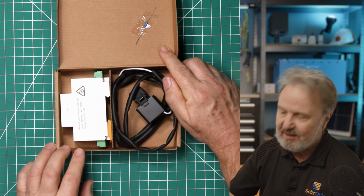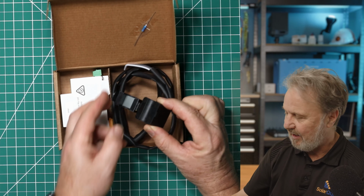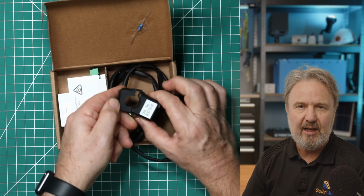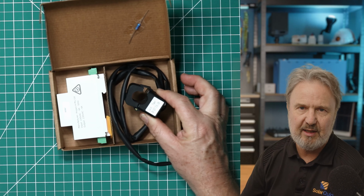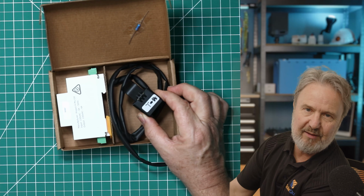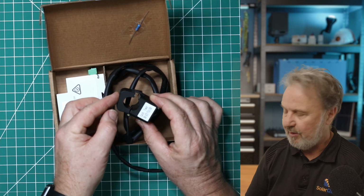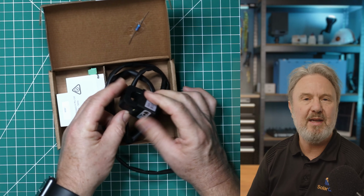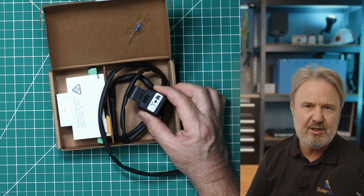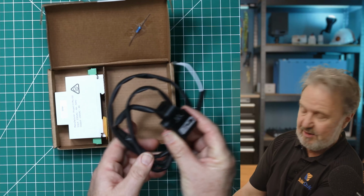What we've got here is a current transformer, commonly called a CT. So this device here is for measuring current, and it can measure the direction of current. And it's a split core, which means that you can clip it over a cable. You don't actually have to cut the cable to install it, but this would typically go over the main conductor coming into your installation, so it can measure the exchange of energy with the grid. But there are other possible arrangements which are covered in the installation manual.